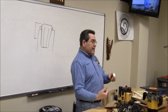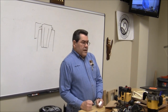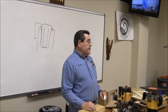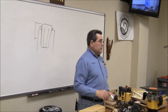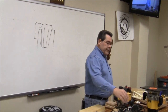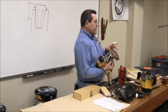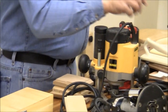When the router is mounted in a table, what happens is you have a base plate on any router and they vary in thickness. This one isn't much more than a sixteenth of an inch of phenolic. This old Craftsman's is probably three-sixteenths. The one on this big DeWalt is maybe an eighth of an inch thick. But now we're adding a drop-in plate on top — this one happens to be about five-sixteenths of an inch thick. The acrylics tend to be three-eighths.